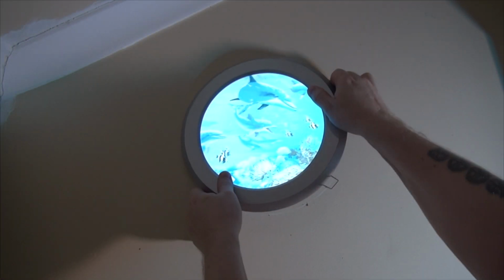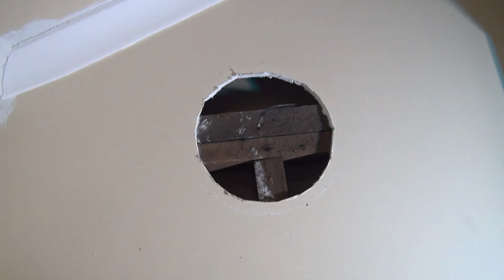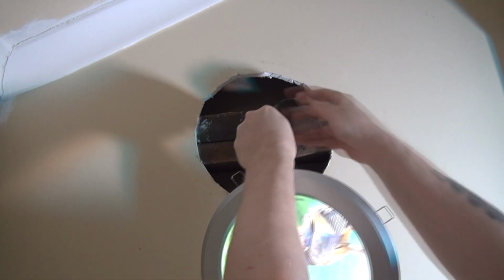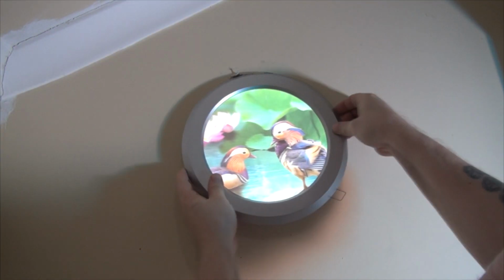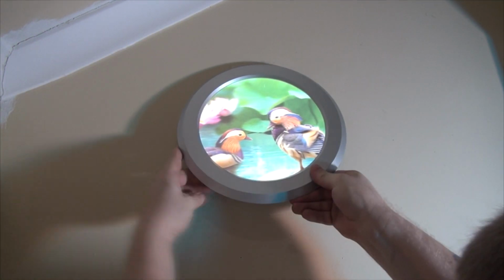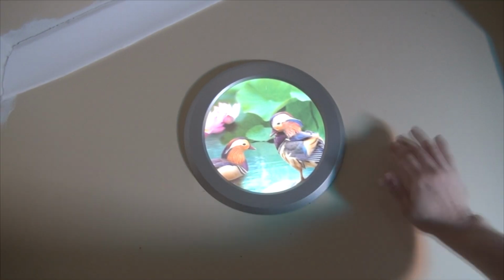It looks pretty good, but let's put in the picture that we've made at my bench. The lights are very easy to remove. You simply just pull it out of the wall. It's held by the clips in the back. Unplug the power connector and the light is removed. Then you just plug the new light in, align the clips, push it in, and it's done, and it looks great.